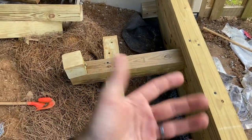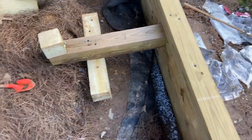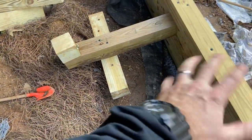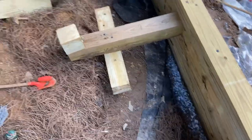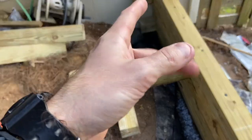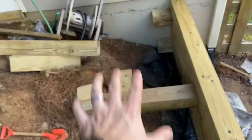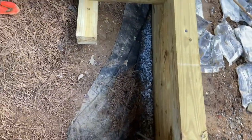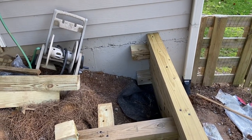I'm going to backfill this whole area with what's called 57 stone — basically three-quarter to one-inch washed gravel with no fines — and that's my drainage rock. The gravel truck is actually on its way right now. I ordered six tons, which based on my calculation should be enough to fill this area.